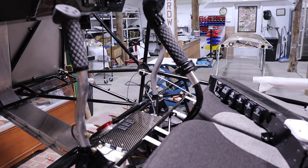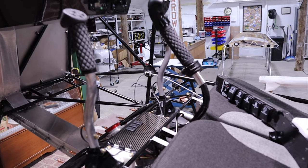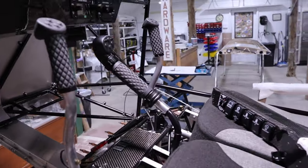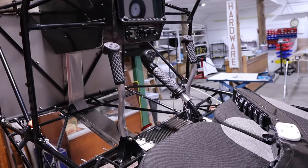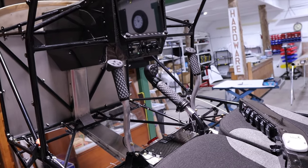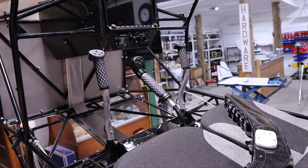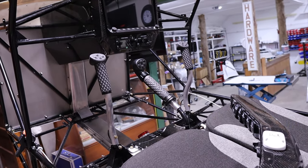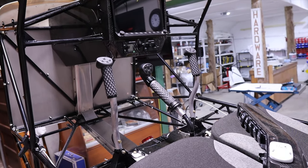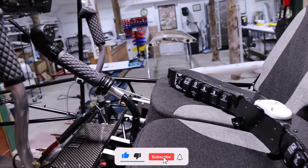The whole intent is that you're always going to have your hand on the throttle, especially when you're coming into a landing. It's got a nice positive lock and location. One concern people bring up is that your passenger could bump it and knock it out — well, the only way he's going to bump it out is if your hand's not on it anymore. I do have a design that uses a clutch handle where you grab it and release it like a normal flap handle, but the problem is it interrupts your throttle control just a little bit. I really like this operation. I did get my headache rack done and ready to install.